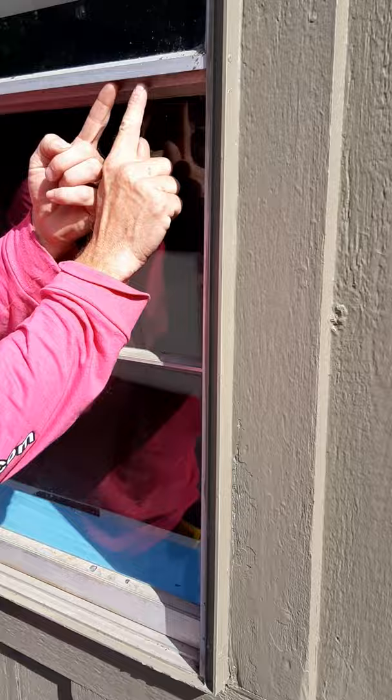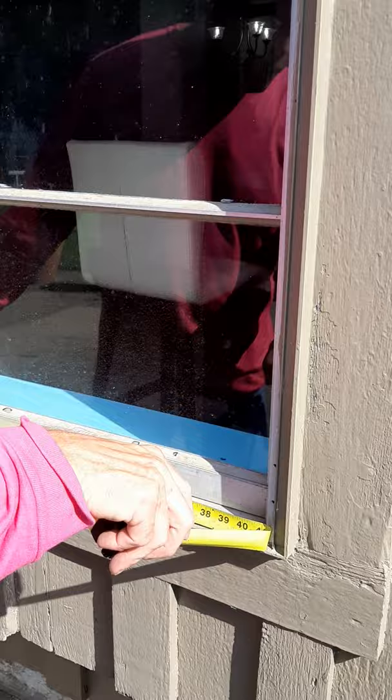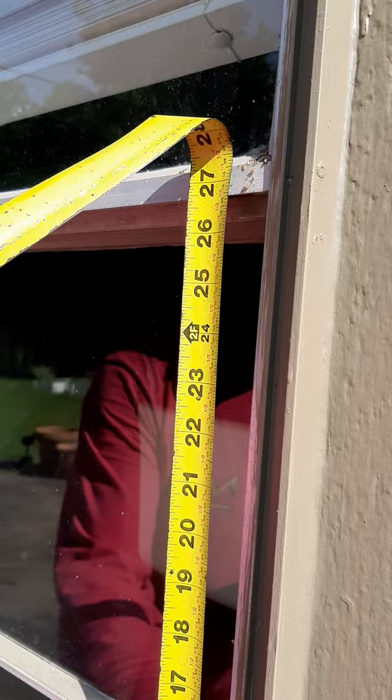As you can see here, there is a track where this screen will tuck up inside. It sits nice and flush at the bottom, and you can see on the inside where this frame will butt up. I'm just going to take a quick measurement, measuring inside that — and that is 41 and a 16th, because we don't want to make it too tight. The easiest way to measure for the height is to start at the bottom and have it where it just barely goes inside. In this case it's 26 and about 13 sixteenths.